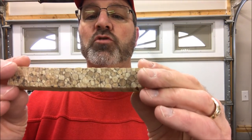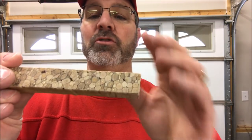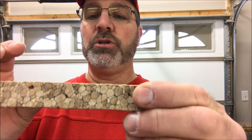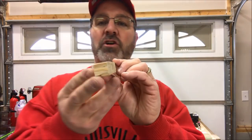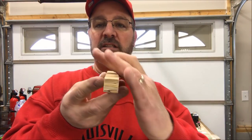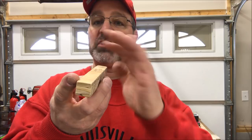What I'm going to do is try to take advantage of thin CA glue — we're going to soak this blank in an effort to lock together these twigs and increase my chance of turning this blank. We'll also remove the corners from the blank so I don't have to hit that hard corner. I can come around and have less of an angle when I turn this into an octagon.